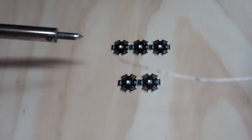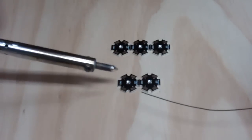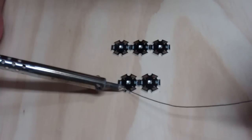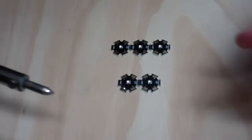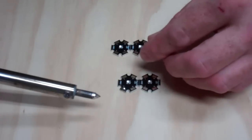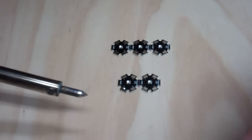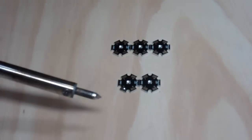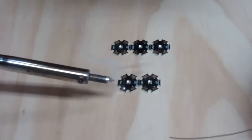The first thing you do is, after you figure out which order you're going to do your LEDs in — I do plus to this side, minus to this side — is you touch the soldering iron to the pad and you push the rosin onto it. That's it, you're done. You don't want to transfer too much heat to the pad. You want to do this off of the heat sink, or else you transfer most of the heat into the heat sink and it takes longer to heat up the pad to allow the solder to take.